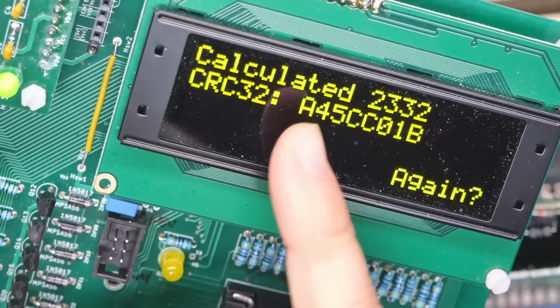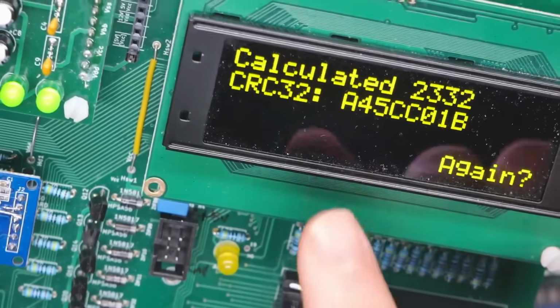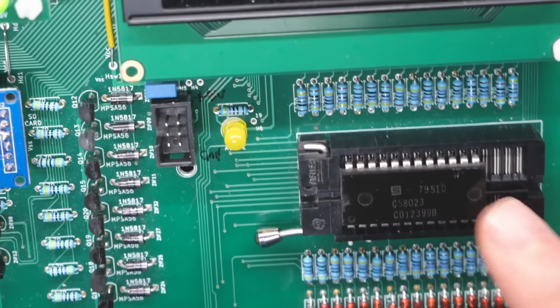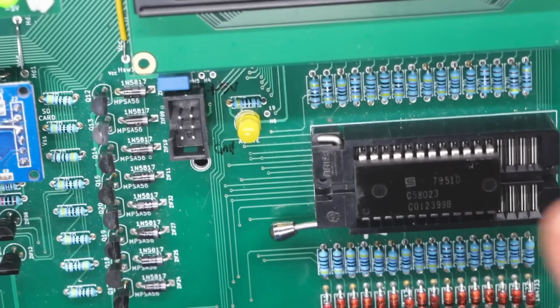See how basically half the chip comes back as blank. That's what those little empty squares mean. And I was just double checking the schematics. This definitely has all the address lines hooked up all the way through address line 11. That is hooked up to this.